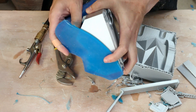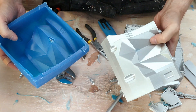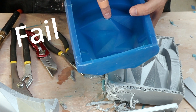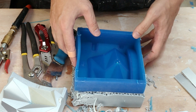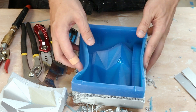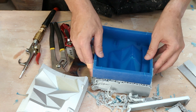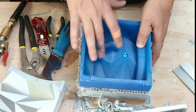I haven't popped the silicone off yet — the inside of the silicone looks to be in reasonably good shape, though I think I might have a little air bubble there. So I went ahead and popped it off, and as expected it came off really easily. But I do have an air bubble there, and unfortunately that is also the face of the pot so it would show up in my mold. I also have a small bubble down here. The idea is that this fits back down into the support piece so I can pour the plaster, but I'm missing all the supports on the side, so at the very least I need to reprint that piece.